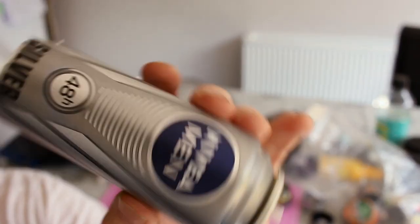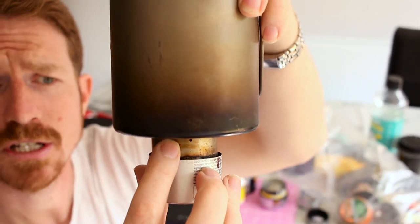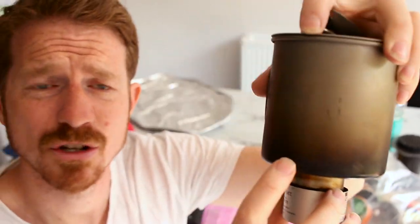My final design - I've used this stove hundreds of times and it's never let me down. It works so well, it really does. This is made of three components, there's no gluing, there's no fussing at all. You've got an internal section which is just a piece of aluminium that I cut from a deodorant can - it's probably twice as thick as a drinks can. You can cut this with a decent pair of scissors. This measures about 45mm - that's not critical, you can adjust that. All it does is set the distance between the pot and the start of the flame.